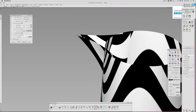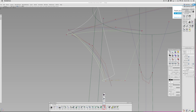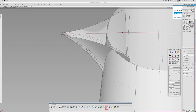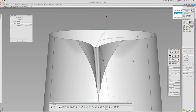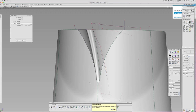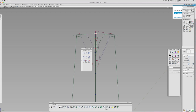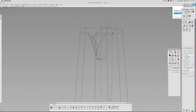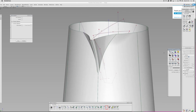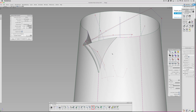By creating that boundary manually rather than doing a surface and trimming it, I've controlled the taper bowing in the middle — it's gone. Now it's dependent on whatever curve I've created. I was happy with how that surface turned out going into the main body of the jug. I've gone straight through the actual side surfaces of the jug, then used the intersect tool and the trim tool. For the blend, I'm going to split that surface in two — so when it comes to filleting, I'm only filleting two surfaces against the one surface, otherwise you'll get a weird start and end point.